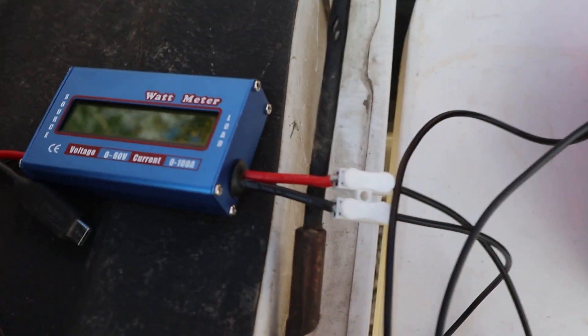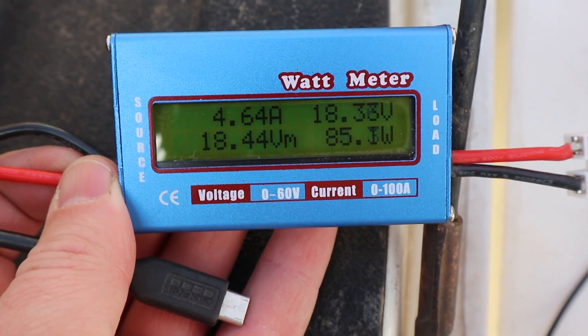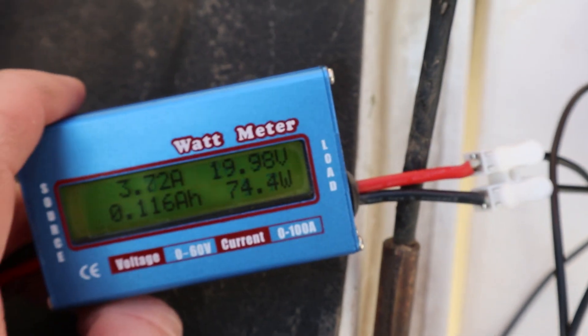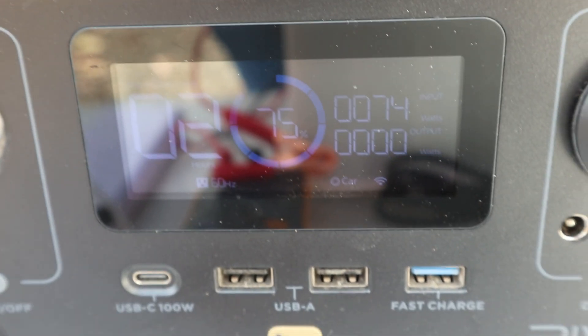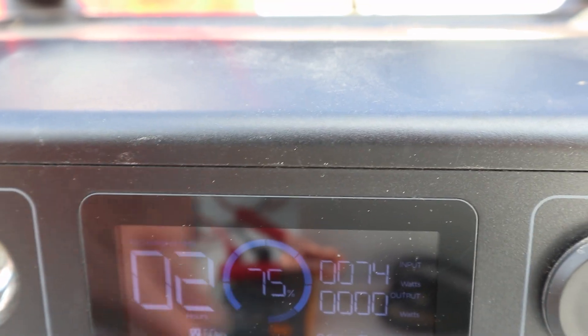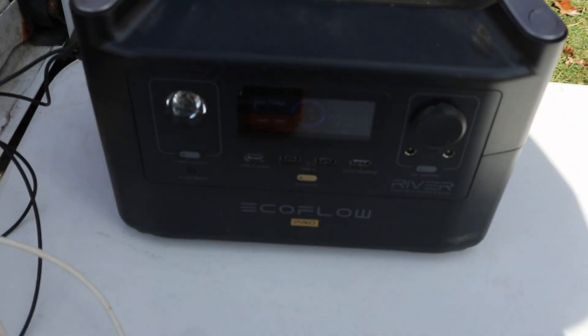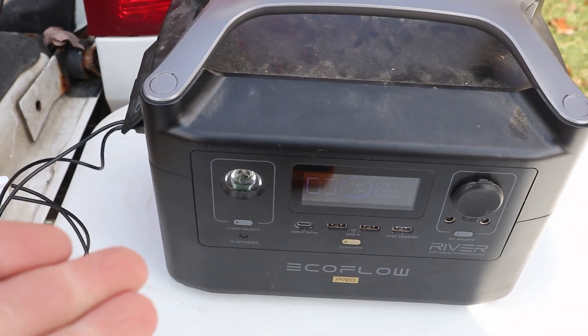With the battery disconnected and drawing full power directly off the solar line, we're getting 85 watts. The reason it's not hitting the rated 150 watts is that the sun is traveling through a lot of atmosphere — it's still low on the horizon in December. Under decent sun on a day like today, the EcoFlow shows two hours remaining at this charge level, so we'd estimate roughly eight hours to fill it. This is a 720 watt-hour power bank.